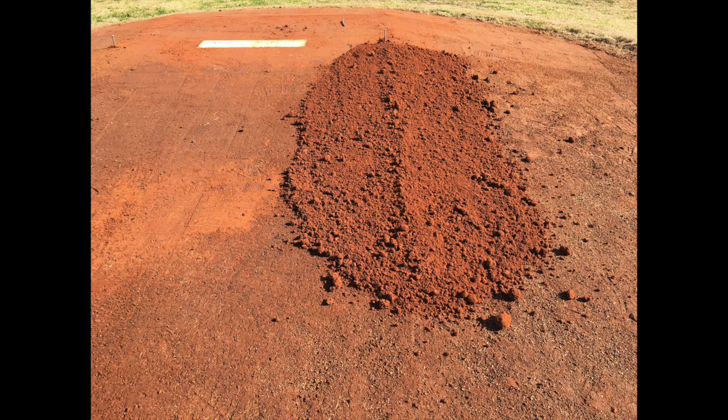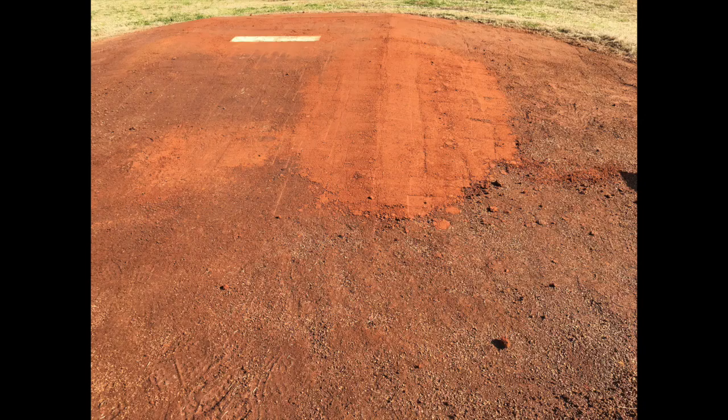And then, like we talked about on all the other sections, we're tamping either completely on the landing area, the 5-foot wide section, or we're completely tamping on the actual side slope. There's not any half and half area. That really creates that nice defined edge line, and it makes it look and appear like a really highly maintained mound and there are no rounded portions.